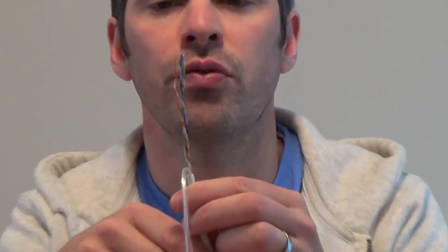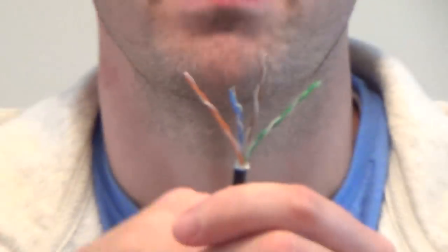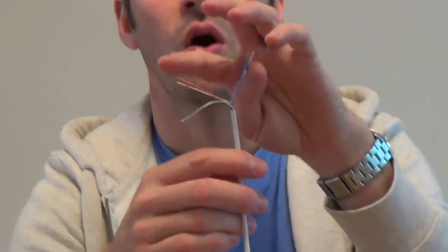This one here is a three pair cable. So there's six wires, three pairs. You've got the blue pair, the orange pair, and the green pair. You also have a four pair cable - this is actually Cat5e cable. So you have a blue pair, orange pair, green pair, and a brown pair. When it comes to telephone extensions, it only uses three wires. That's one pair and then another wire for the ringer wire. So you don't need to use four pair or three pair cable.